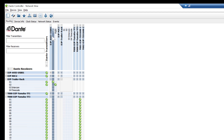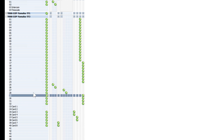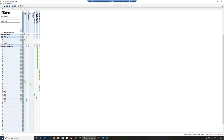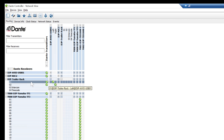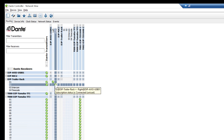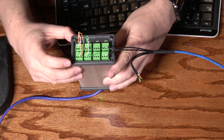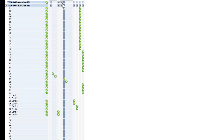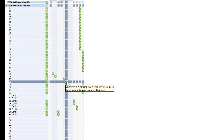Next: audio quality. I'm going to play a little bit of audio. What we have here is audio sent out from the computer. I'm using one of the AVIO units from Audinate going directly into my mixer — I'm using the TF3, so that's on channels 25 and 26. That same audio is also being sent to my Ben & Fellows unit. I have the audio from the computer routed into channels 1 and 2 on that unit, and outputs 1 and 2 routed back into inputs 1 and 2 — just a straight connection. The inputs from that unit are then routed to channels 27 and 28 on my TF3 mixer.